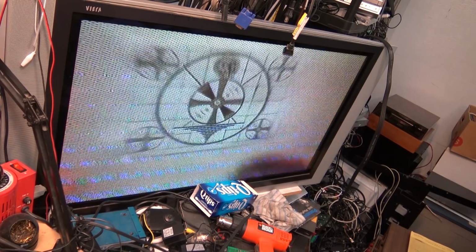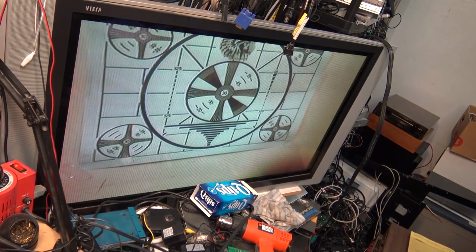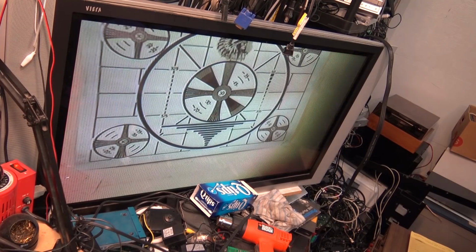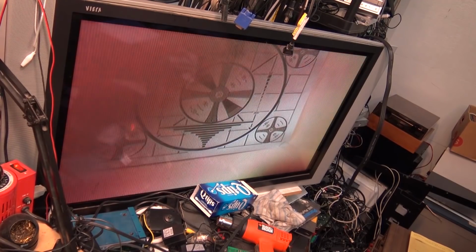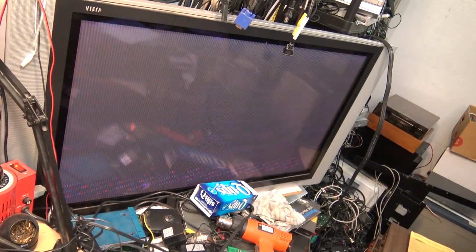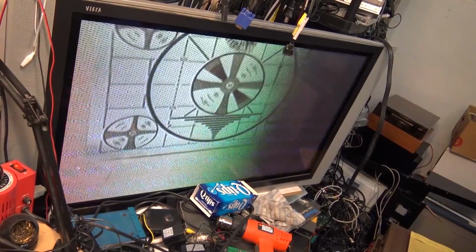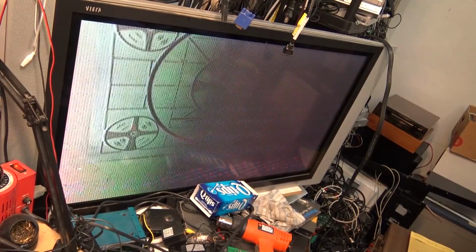Focus. There's the manual iris control, and if I plug the, of course its lead is too short to plug in. Yeah, the lead's too short to put it on auto iris on this camera. But as you can see, the manual iris works fine. I think if I probably turn this lens a bit, it'll affect my focus, but now it'll reach.